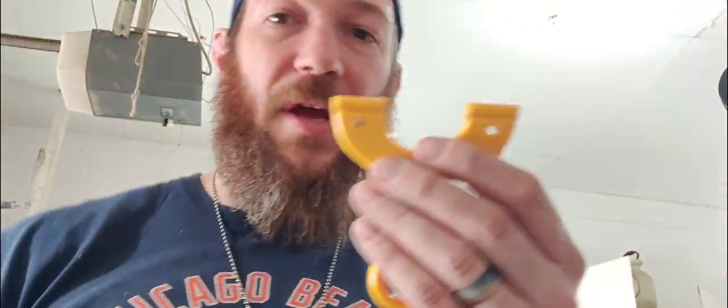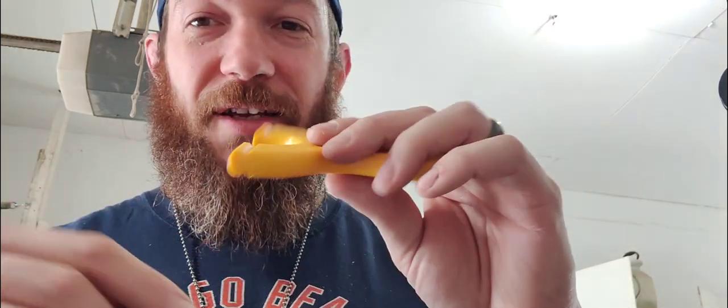When you use a drill on HDPE, you have to really hold it down because it'll just climb right up the bit and it'll wobble while it does it. So your hole will get really, really nasty looking. Not good. Yeah, that was a perfect one.